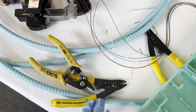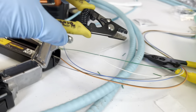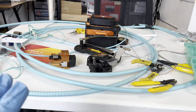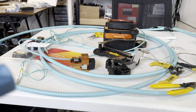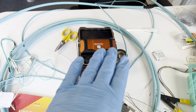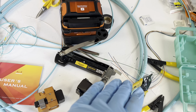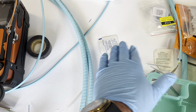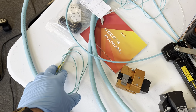When you cleave, you will use strippers — there are various different strippers with different gauges. For termination of fiber, it's not that difficult. The terminology and the physics behind it — wave packets, wavelength, dB signal loss — that's a whole different ball game. But termination itself: make your connections, cleave them, clean them with alcohol. You just want to make sure your tips are good because the transmission of light is totally what it's all about.